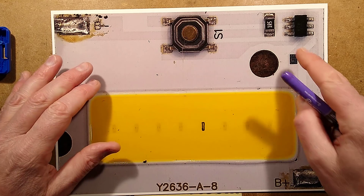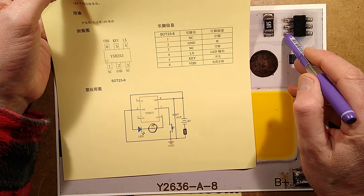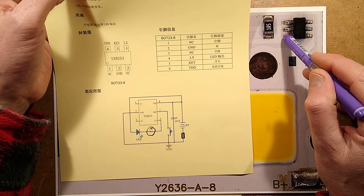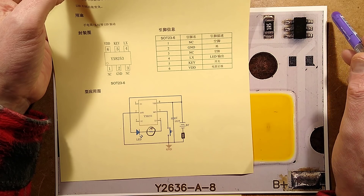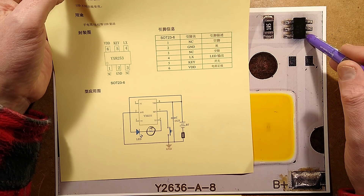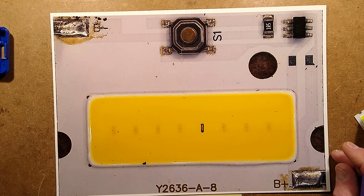I've checked the pin-out. The datasheet shows the middle pin as ground, but all the pins were connected together — I've seen another device using the same YN890 chip do the same, so I guess it's just for heat sinking. The positive pin is at the top, the middle pin is for the button, and the bottom pin goes to the LEDs — with visible bus bars running inside at top and bottom. There are three screw holes: two hold the LEDs against the plastic reflector, and one provides rigidity for the clicky switch.